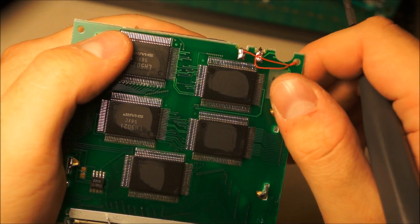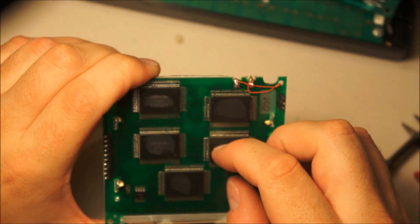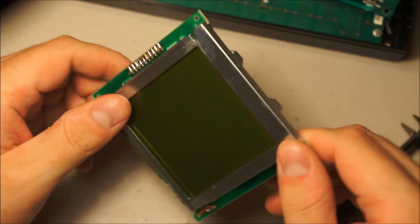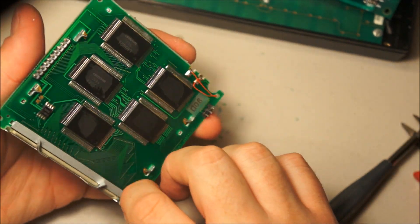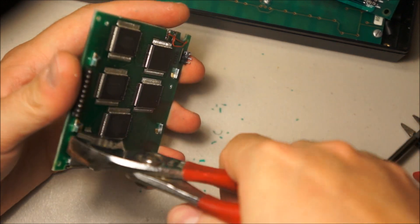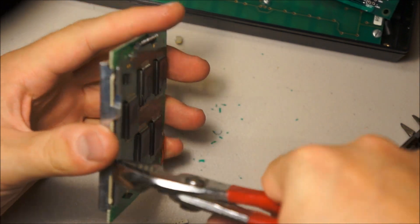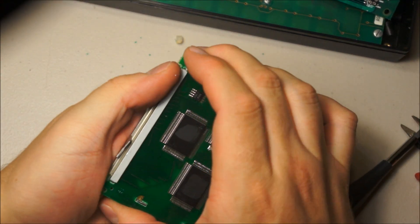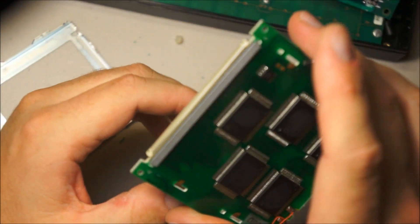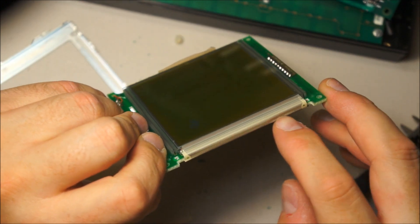My camera may overheat in a second. You can also see that they've gone through the effort to scrub the name off these LCDs, because that would be too useful — what with their cutting edge horrible bodge jobs here, you know, somebody might rip them off. Let's see if I can pop the front of the LCD off and confirm that it is indeed electroluminescent. Just have to bring the tabs up, and then the LCD just kind of peels apart. Oh my. So actually if you look — this apparently predates zebra strips.